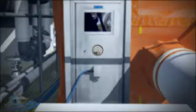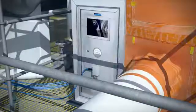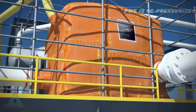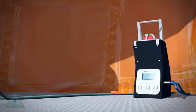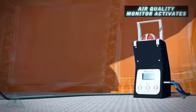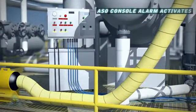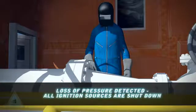Critical to the success of any pressurized welding enclosure is maintaining a positive pressure overbalance inside the enclosure. Unplanned actions, such as inadvertently opening the access door, will lower the internal pressure to less than 0.05 and activate all components of the ArcSafe system. Audible and visible alarms are activated inside the enclosure and at the ASO control panel. All ignition sources are disabled while ventilation continues so workers can safely exit the enclosure.